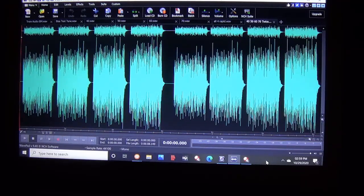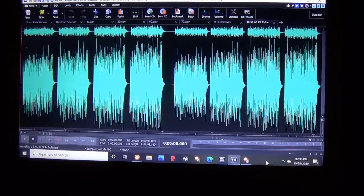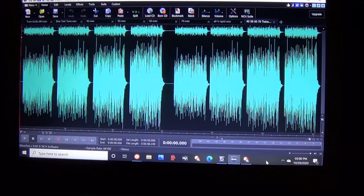Now, the way we'll do this is I'm going to connect the output of the amplifier to an oscilloscope. I'm also going to connect it to a dummy load so that we don't harm our output transformer, and also since it's not connected to a speaker, we won't have to listen to the god-awful noises that will be made during this evaluation. Then I'm going to input a 2 kilohertz and a 10 kilohertz steady signal into the amp. We'll go to the oscilloscope. We'll crank the volume up on the amplifier circuit, and we'll stop at the point at which distortion starts to appear in the waveform. Then we will use the oscilloscope to measure the output voltage from our amp that is associated with that very beginning of distortion.